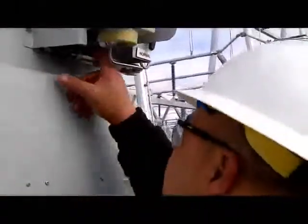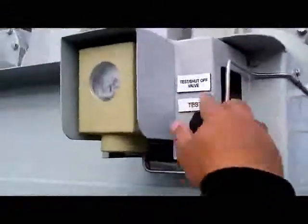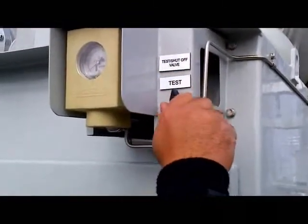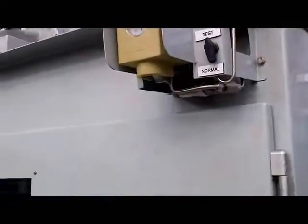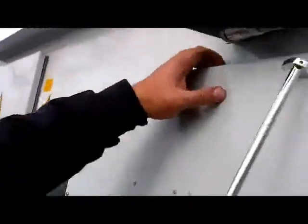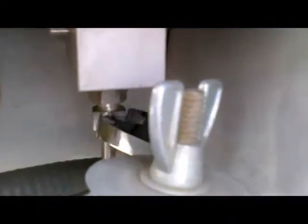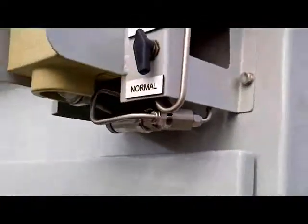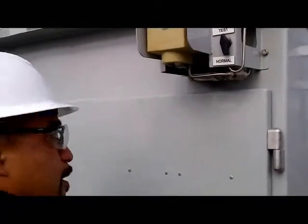Okay, while this nut over here is still loose, you can purge the valve or any gas in there. The remaining gas inside here is enough to do that, so you can hear that squeeze noise. Then for the final touch, tighten up that nut. Okay, we're done with all the connections and tubing and the sensor.